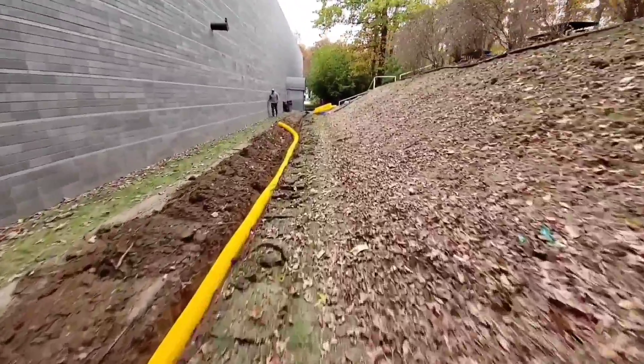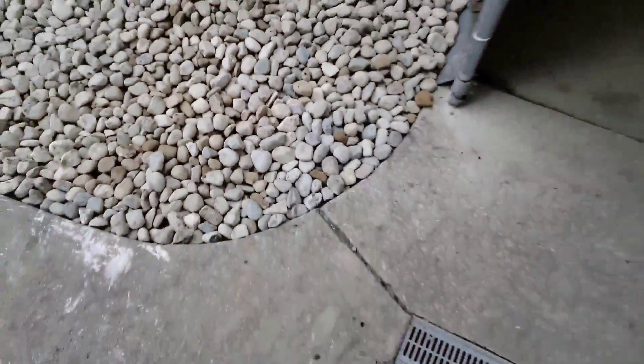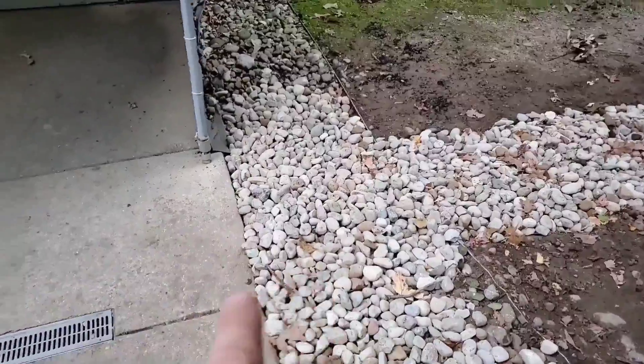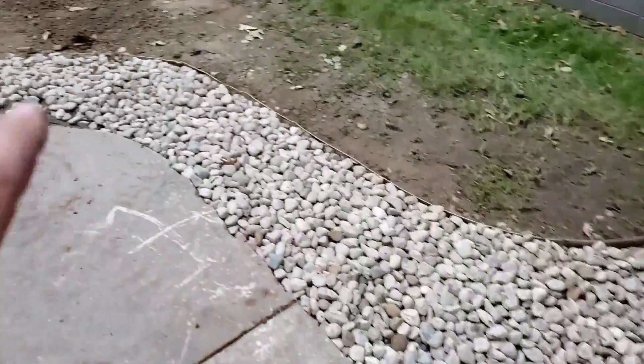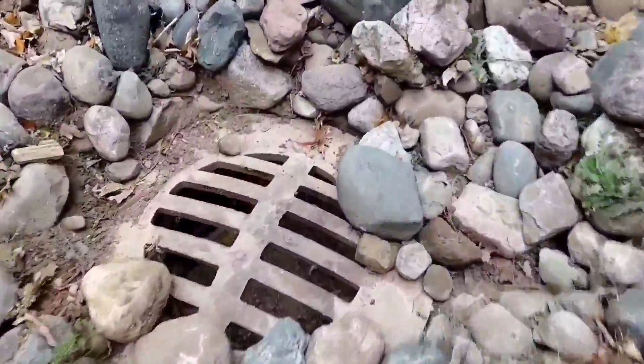Commercial job sites, you want a spotter in the trench no matter what. Let's take a look at the finished product — all top-dressed really nice with inch-and-a-half round rock to hide those basins, because they're kind of an eyesore. Put the stone right over top of them. Really nice clean job. The grass was real thin here so we couldn't save it with a sod cutter like we typically do — it just fell apart. So we went ahead and put some grass seed and straw in. Give us a thumbs up if you want to see more videos like this, and if you have a specific video you'd like me to make, please leave that recommendation in the comments.